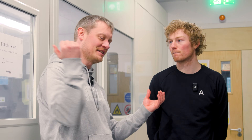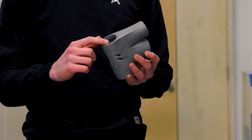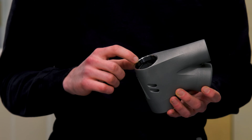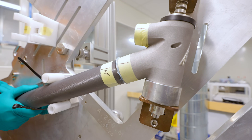Once fettling is done, it's not far off being ready — but first the critical tolerances are all machined in. Head tubes, for example, are printed with extra machining stock — a small amount of additional material printed in that can then be machined back using a CNC machine to a much higher level of precision. Here's a machined head tube, ready for the headset cup with really tight tolerancing. The parts are then doused with IPA to clean all the joints and ensure everything is free of contamination, after which they're loaded onto a jig, filled with glue, and tubes installed — on to bonding.